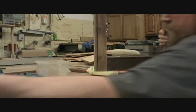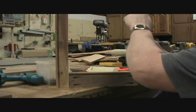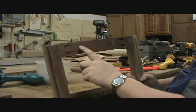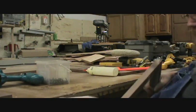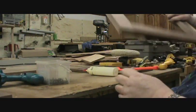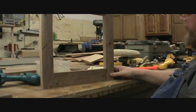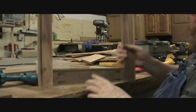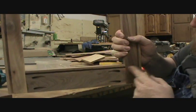This one here, I got to remember to do it before I put the base together. I'm going to put pocket holes here and here to hold the top down. Also, if you got a surface sander, you probably know to make sure you get the glue off, because otherwise that destroys your belt in a heartbeat. But there is the base face frame. And this groove here is for the floor to go in. When you make the tongue there, you just take and route off the excess.